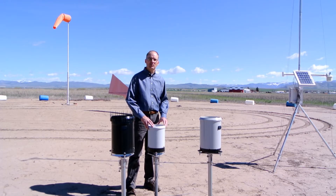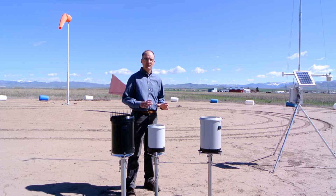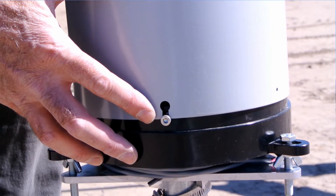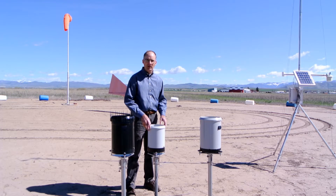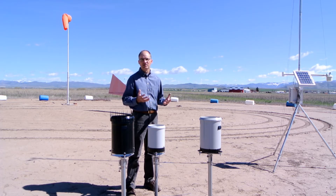The original rain gauge we shipped with our weather stations was the RGTB6. It's been an exceptional performer — it has a 20 centimeter orifice, key slots for the screws so when you take off the top you don't have any loose items, a bull's eye level inside, a chrome plated tipping bucket, and a ported discharge port so you can capture the rain to do measurements later. All in all it's been an exceptional rain gauge, free from any field anomalies or problems such as insect intrusion.